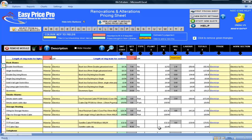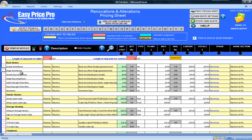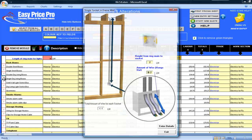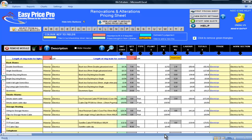But if you wanted to change them, you can easily enter your own figures into the boxes and the programme will adjust its calculations to match your selections. If I quickly click the red question mark for the single steel boxes, double dry lining boxes for the stud work walls, and the single dry lining boxes, you can see that the same format applies, so you are able to adjust any of the drop or overhang measurements to meet the needs of your job.